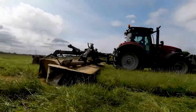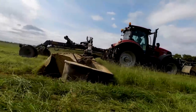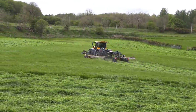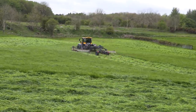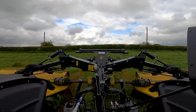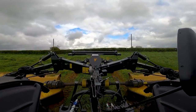The demo set last year is the 33-foot, so we're saying for the 33-foot about 232 to 240 horsepower would be comfortable with it. So for the 30-foot, you're looking at 180 to 200 horsepower, depending on crop and ground conditions, hills and all that. In testing over the last couple of years we've had them on a lot of various makes, 180 all the way up to 390 horsepower.